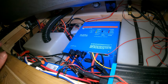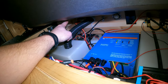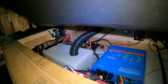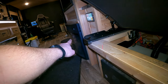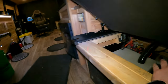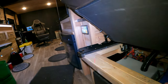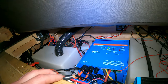I added this — it's a Victron Multi Plus 3000, I believe. That does all the inverting. I tied the main wire coming in — I still need to clean that up. Luckily I haven't started anything on fire yet. The main feed from the generator or shore power comes in here and then feeds my whole panel. I'm going to add a sub panel that would power the electric fireplace and the refrigerator separately, so that if the generator dies or I forget to turn it off some night, I don't wake up to the batteries completely dead — it draws a lot of juice and would run both batteries dead in about 15 to 20 minutes.